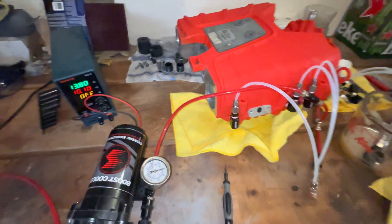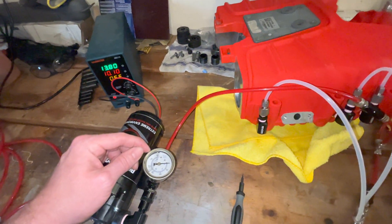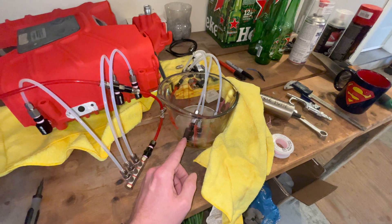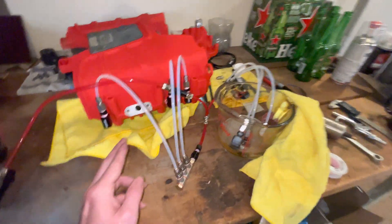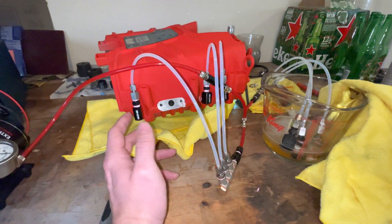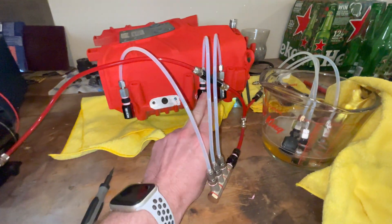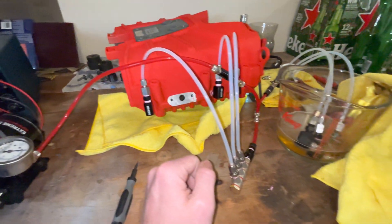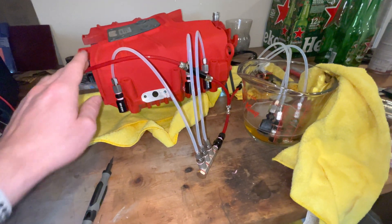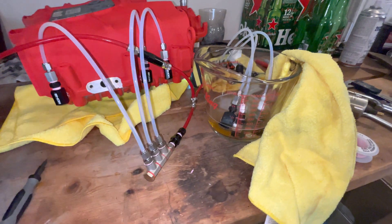If I boost this pump off by tightening the screw right here, it will actually bring this up to 280 psi. This will actually do 125 milliliters per minute. So what we figured out is I can put in six of these and have 600 milliliters per minute, or 600 cc's. I've also tested this with just a six-gallon-per-hour nozzle out of this - just one six-gallon-per-hour nozzle. I have a video on that as well for four, six, and I think 12.